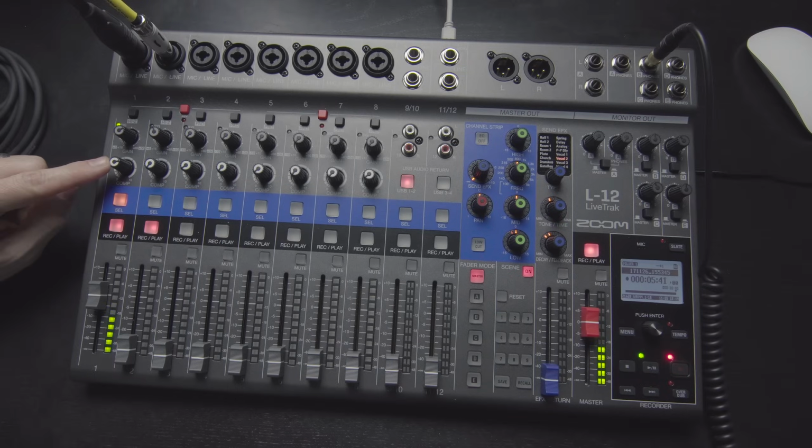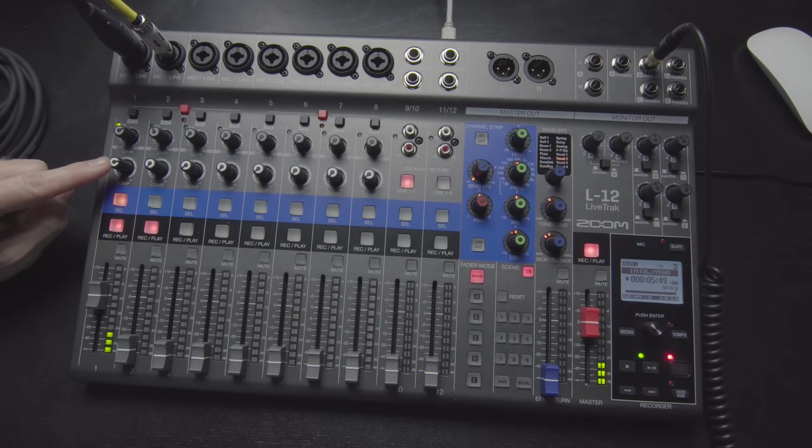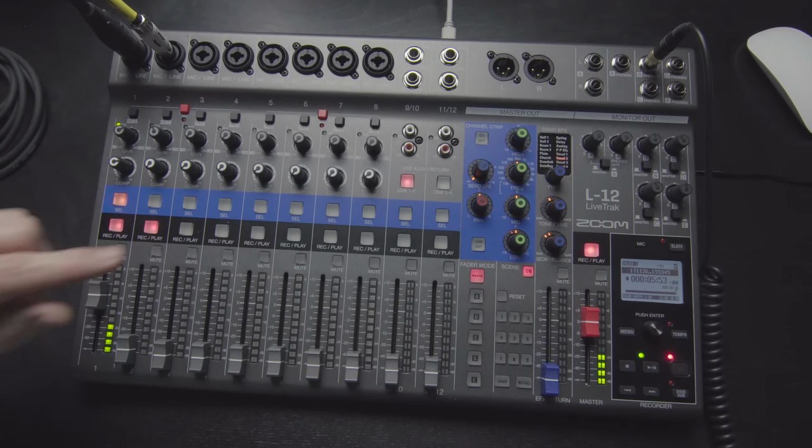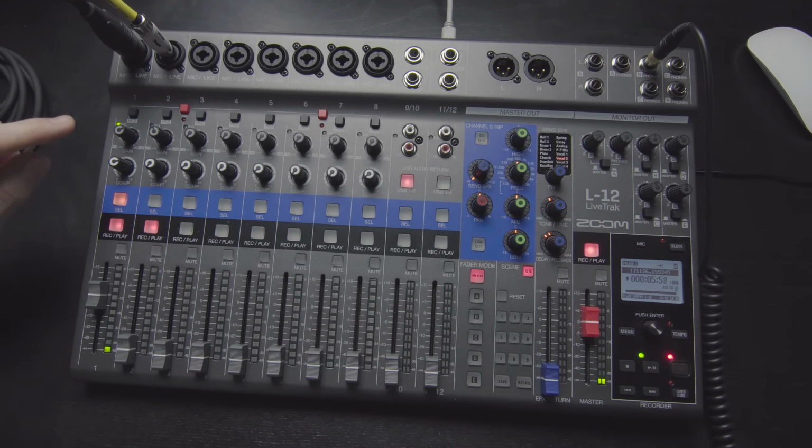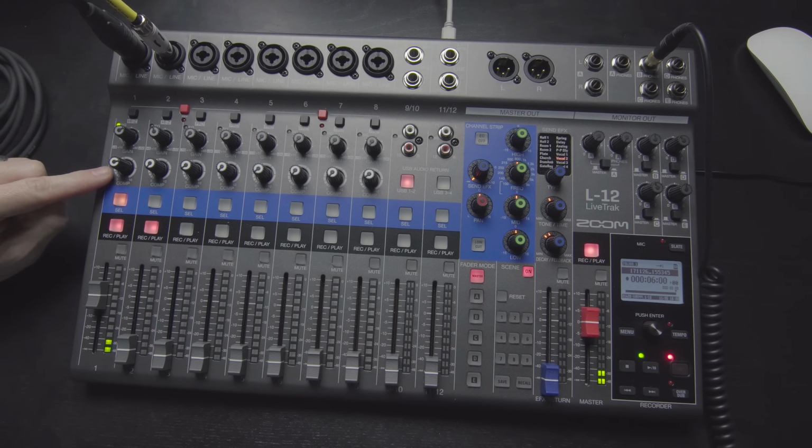And this does a good job in cases where you get really loud. Hey, hey! And that protects it, at least on the USB out, if you're going in via audio interface and onto the SD card recording the separate channels. So I do like using the compressor, even though you are baking that into your file. If you didn't want to put any compression on, then turn that off and go with your preamp. And then I assume you're not going to get loud enough to peak the audio.